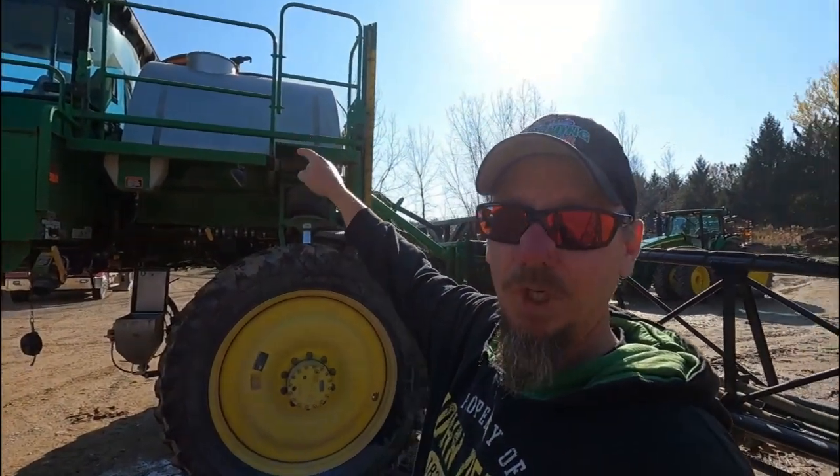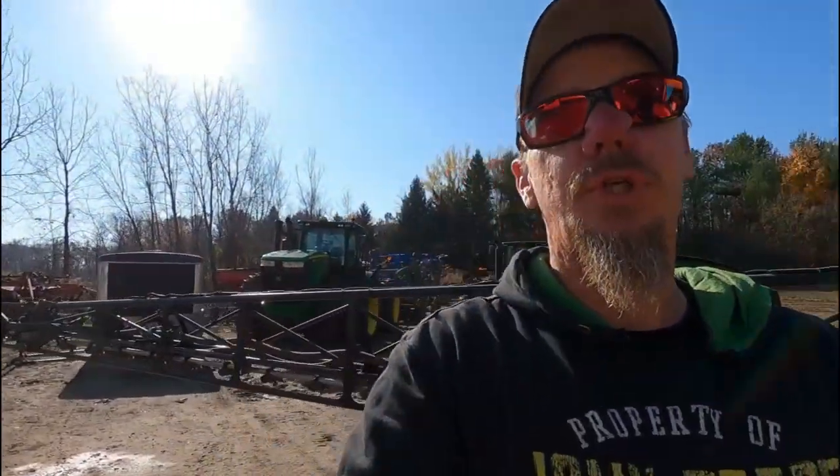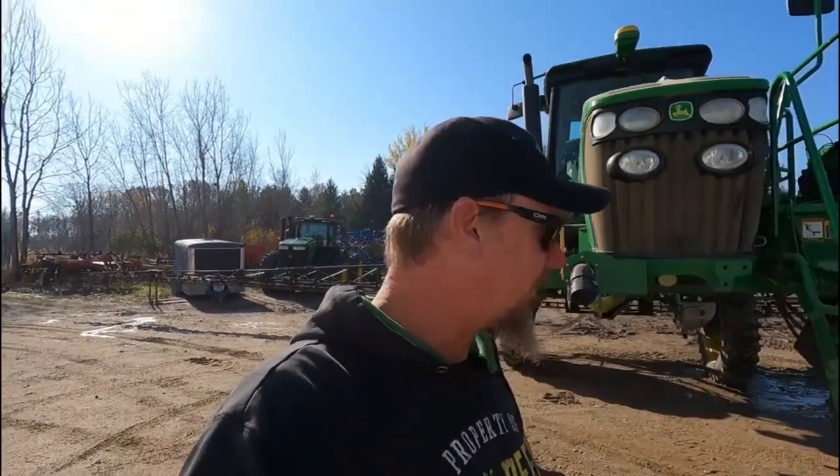So that's why I pump like 20 gallons into the big tank up top first to get liquid into the system, and then I'll turn the pumps on and start doing everything else. Just FYI, I do have the booms drained right now. I've got all my low points drained now. So I have all the liquid out of this machine that I can possibly drain out just by opening up drains. So now what I need to do is go get the RV antifreeze that we're using, get it up top there and start pumping it into the tank itself.